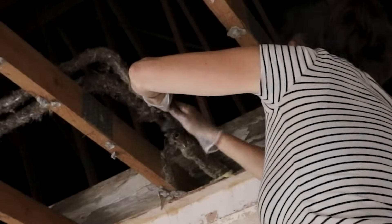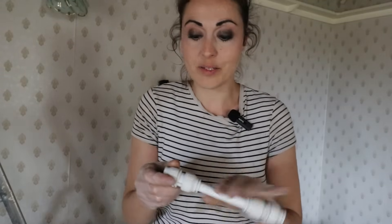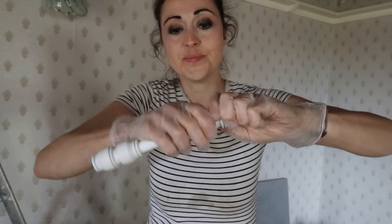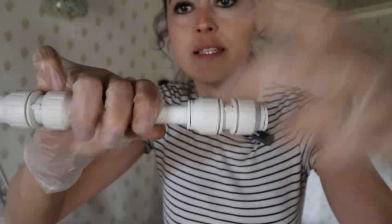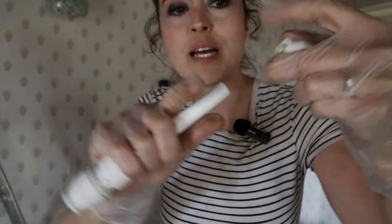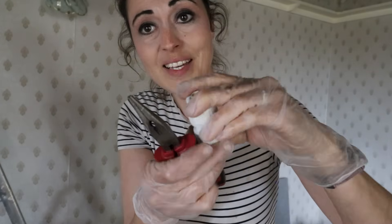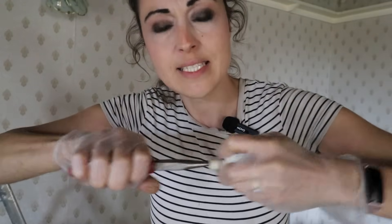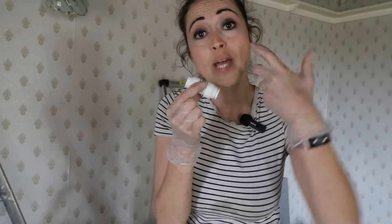It's achy work up here. I'm going to disconnect this and push it in — I've got the dirtiest top on ever. There'll come a time when you need to disconnect speed-fit fittings: unscrew this piece, and see this flappy bit — the collar — you need to make sure that is pulled in, then go like that. Sometimes you'll have the inserts stay in there which is a bit irritating. I use some pliers — this is what stops it from leaking. To connect these to copper I don't need the inserts because the copper won't cave in when I screw them on.